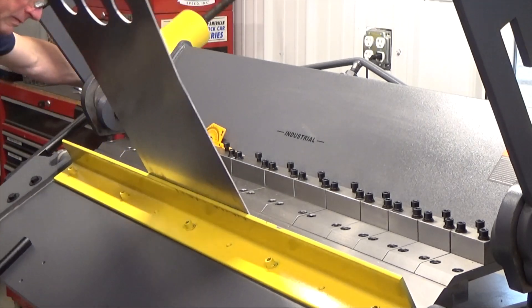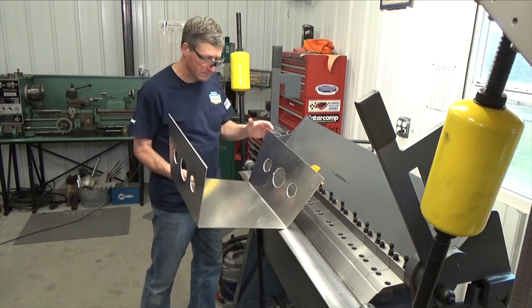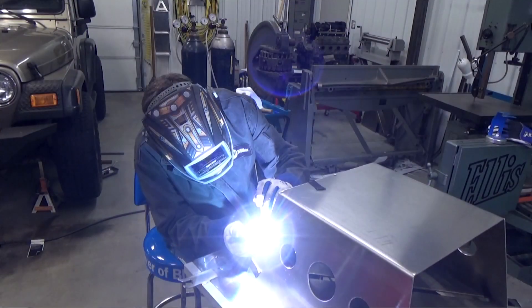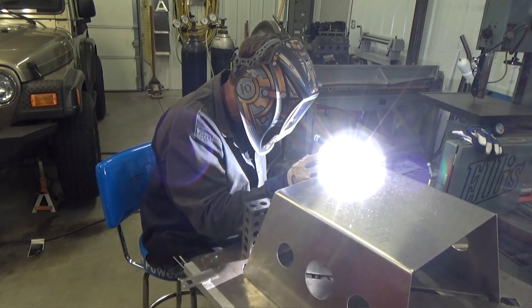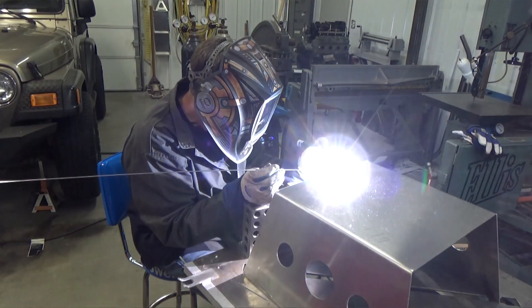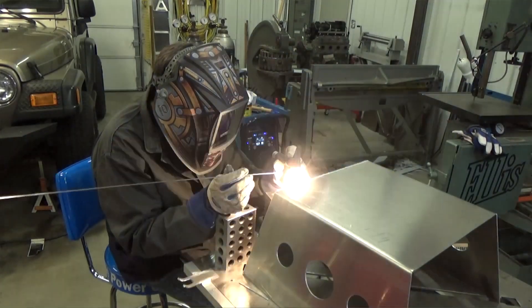It's time to bend these — I'm looking for about 78 degrees. This is the type of fitment I'm looking for on the weld joints; I'm not fully overlapping the side pieces. To help with tacking, I'm using a couple strips of duct tape to hold the seams together. Remove it quickly and use acetone to clean any tape residue. I'm using 3/32 5356 filler metal, starting at the top seam and then the sides. I have my Multimatic 220 AC/DC set at 90 Hz and 72% on the balance. Remember to prep and clean all your weld joints with acetone before welding.